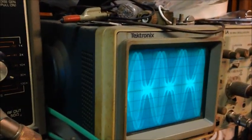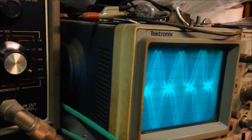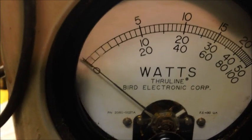There's reference. There's some signal through it. As you see, and look at them negatives. Beautiful, man. This is a Keydown radio. I mean, it's upwards of about 300% on the positives. This thing is just bad to the bone. Let's get on. Working at the 100 watt slug in there. So of course we're going to read the bottom scale. About a 3 watt dead key.